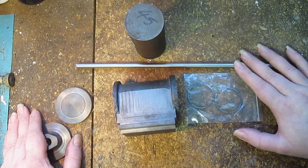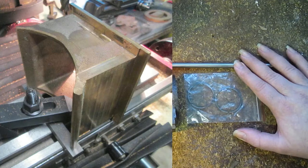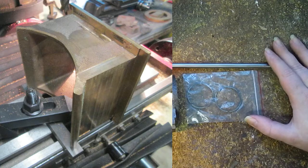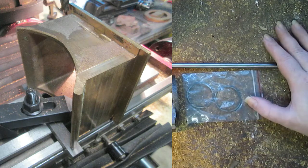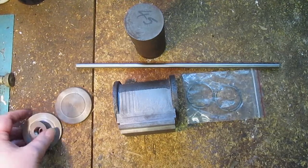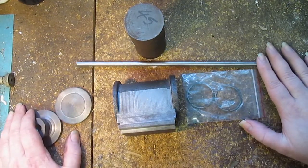Get the chassis running on air this year at the very minimum, and then see where we go from there. Boiler fittings, smoke box, and chimney would be nice to get done. I've been working on the smoke box saddle, which is a large bronze casting — I started on it when I was boring the cylinders, just doing a little while my cut was running. It's taking a while, but at the moment I actually need to get that done because that job is holding up the cylinder milling. A video of that will probably turn up at some point.